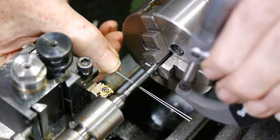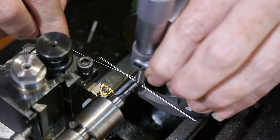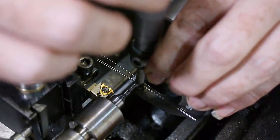By contrast, the thread on the final steel part that I failed to film went almost perfectly. Once again, I checked the dimension with threading wires. I'd overshot my target by a couple of hundredths of a millimetre. Good enough for a first prototype.